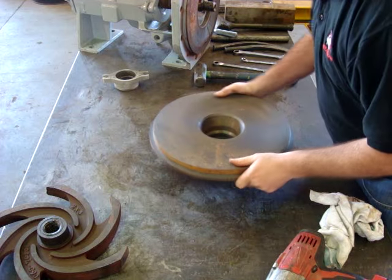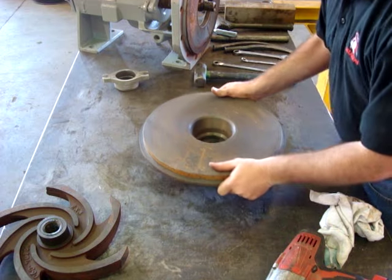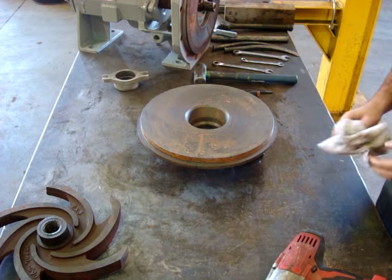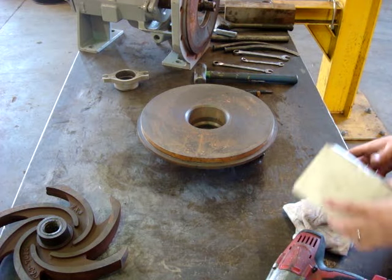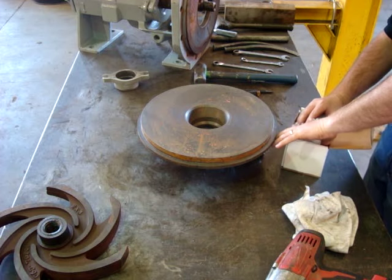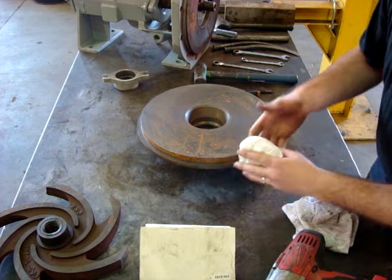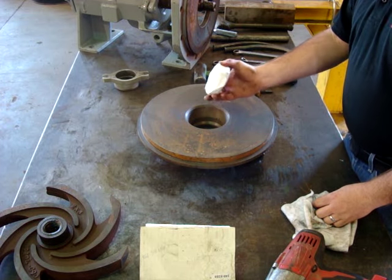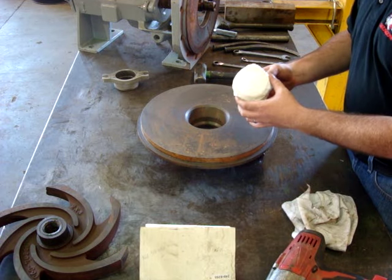On our Dragon stuffing box, we have a slight pin in here — that's where the notch of your stationary will go. Not all pumps have it; it's not a big deal if they do or don't. We'll now remove our mechanical seal that we got from one of our Dragon service centers and get the stationary. The stationary is always wrapped in a nice clean rag, for the purpose of cleaning your faces after you install them and before you put the new one together.